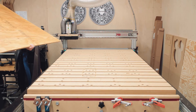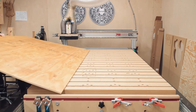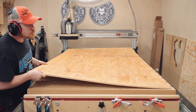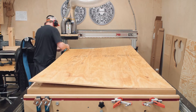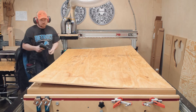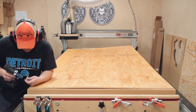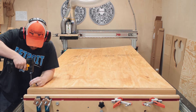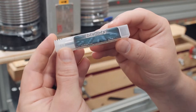Speaking of plywood, I'm using one of the worst batches of half-inch pine CD-rated plywood that I have ever used. As you can see, it's warped quite a bit, but I went ahead with the build because I thought most of the warp wouldn't be evident in the smaller pieces. This is a shop project, so I secured the sheet goods with washer head screws instead of plastic nails because the bow resistance was just too much for the plastic nails.